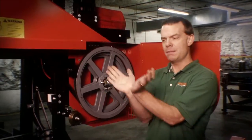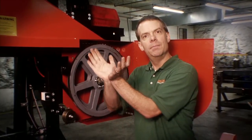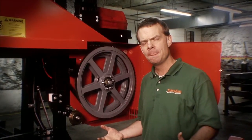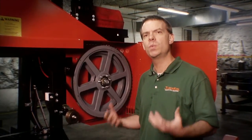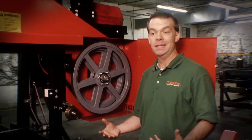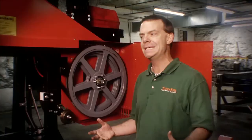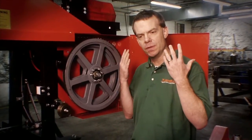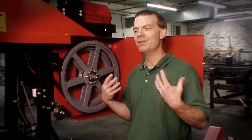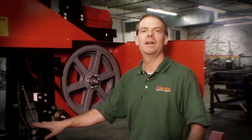The other problem when your blade is cupping — what does that blade want to do when it gets in the wood? It's like the rudder on a boat. It wants to wave, because it's cupping on that solid steel wheel. So if somebody tells you solid steel wheels are better, they're not lying to you — it's a legitimate difference of opinion within the industry. But I can say straightforwardly that we have done it both ways and sold mills proudly with solid steel wheels. When we started putting rubber wheels on, the mills became much more user-friendly. Customers were happier, they didn't have as much downtime, and when they did it wasn't long downtime and didn't involve an expensive trip to the machine shop. It means they've kept their blade in the wood more — and that is why you have a sawmill.